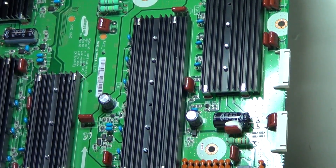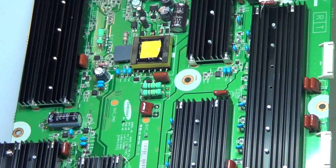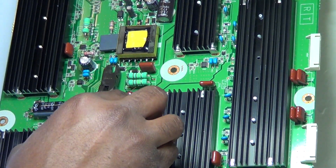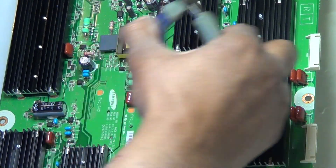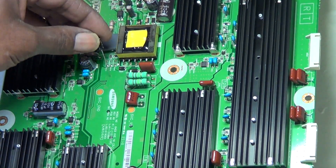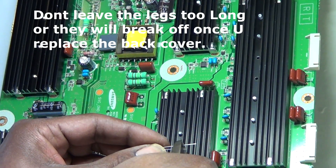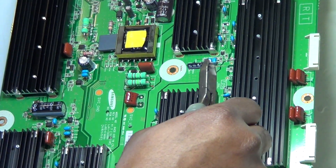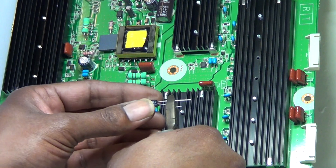Here's how simple this is going to be. Just take your wire cutters and clip them off — that simple. Take the new capacitor, cut the leads so they're even — about midway — give yourself enough room to solder. Don't cut all the way down to the end because you won't have enough room to solder it on there.